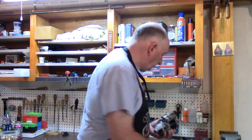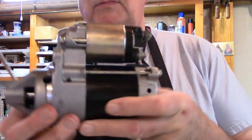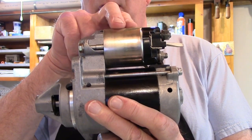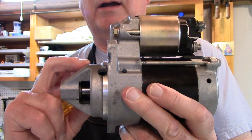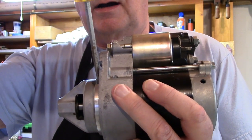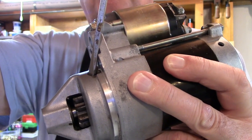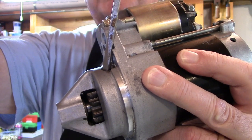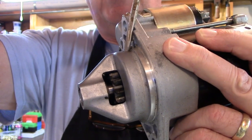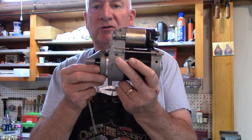Let's take a look at this one. I pulled it off the generator so you can get a good look at it in good light. The starter has three principal working components: you've got the solenoid, you've got the Bendix drive, and inside the Bendix drive you've got a pinion gear. See if I can pull that pinion gear out so you can see it — there it is. It's spring-loaded and it retracts. Normally it's retracted when not being started, and when you turn the ignition switch, that pinion gear pops out, turns immediately, and engages the flywheel on your engine to spin it over.